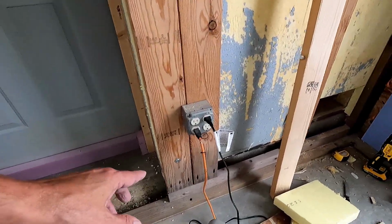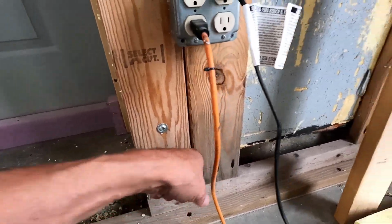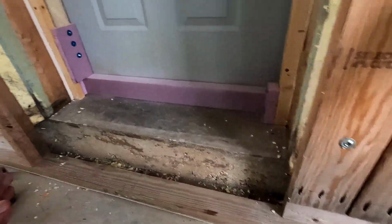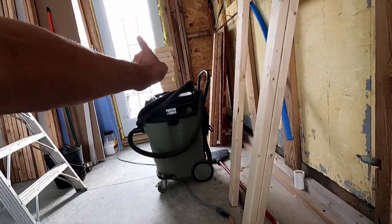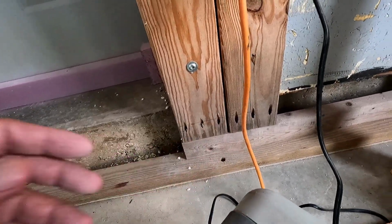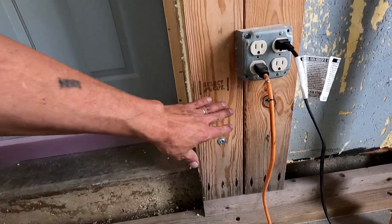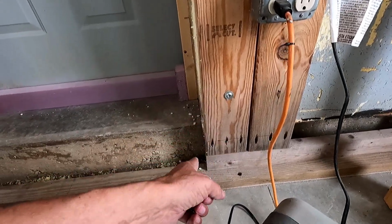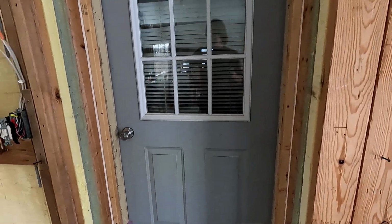Oh yeah, the top board on this, once these are gone, I'm putting that board across the top of there, and then my half studs, which are all them little ones right there, need to be cut to width, and those are just going to be attached right up to the face of this. So this board, then electrical, then pull these, and then get that board in, and then I can cut these to width, and that should do it.